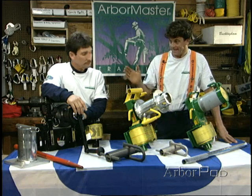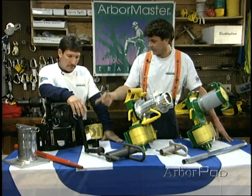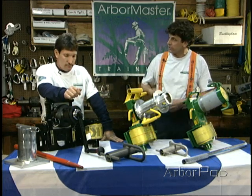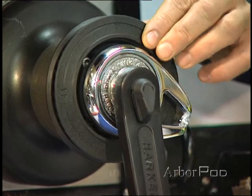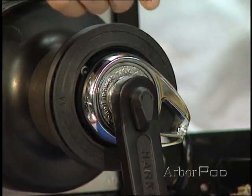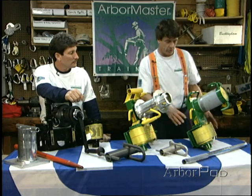That is a very nice piece of equipment and we would not want to damage it. One thing I'd add is that I really like the self-tailor, which allows one person to lift and tail the line by themselves — a very nice feature. It really is ingenious: the rope is pinched between the two parts of the self-tailor and holds it in place.